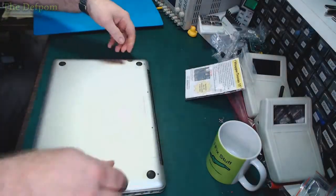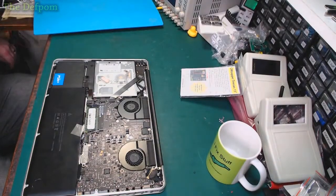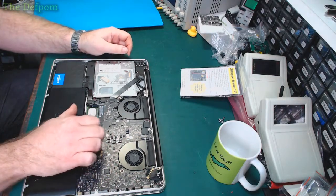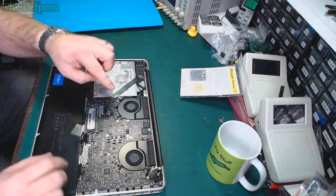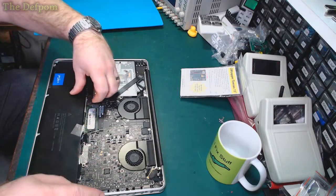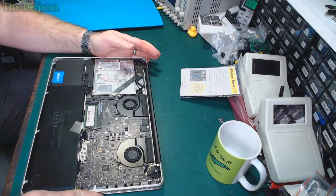No, we'll get to that. So, when you work on these things, the first thing you'll do is pull the battery out. Don't want to zap it. Before you put any other plugs, pull the battery. So we've got to take the motherboard out of this. The SPI ROM is on the other side of the board. And the other thing we've got to do